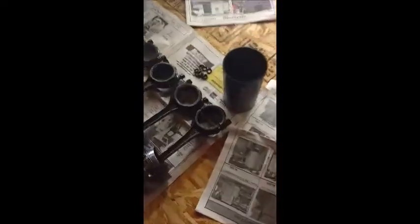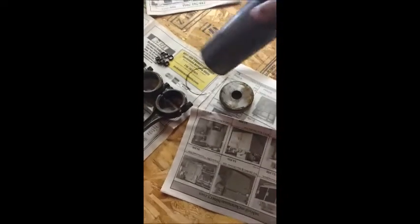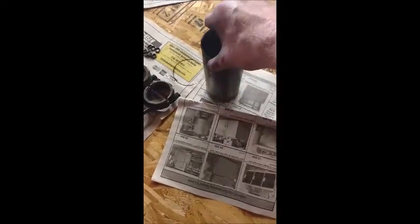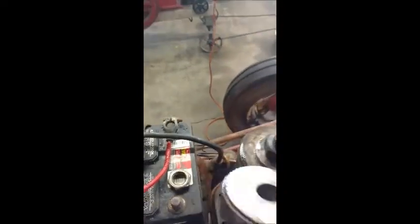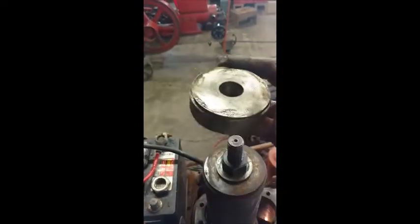I made this bottom puck because I didn't have one that already fit the sleeve. The puck fits the bottom side of the sleeve. From the underside, you put the rod through the hole in the puck and fit it up into the sleeve, then put a nut on the bottom side — the nut goes up against the puck that is now inserted up into your sleeve.